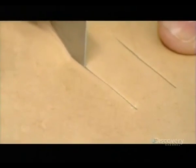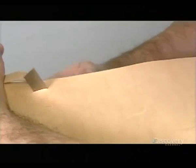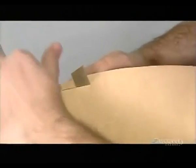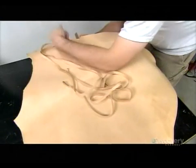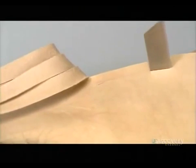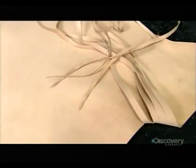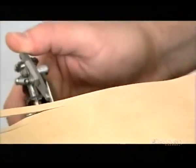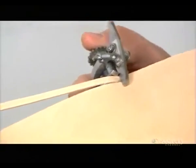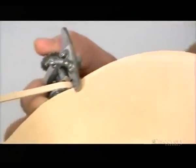The internal construction of the whip is made of 2 layers of braiding called plaited bellies. Separating each braided layer is a solid piece of leather called a bolster. It encircles the braided belly layer under it. Then, covering everything, is a final outer layer of braiding called the overlay. They cut the strands for the bellies and overlay by hand, using a tapering cutter that's specially designed for whip making.